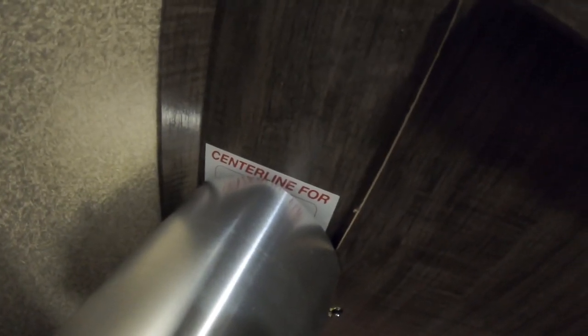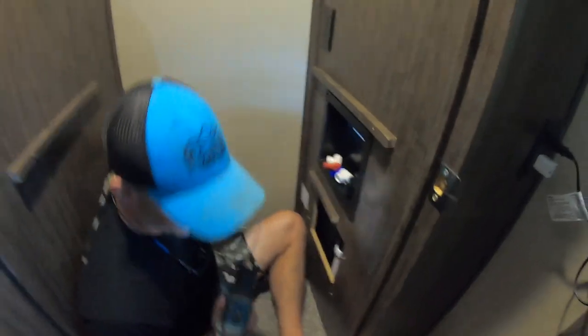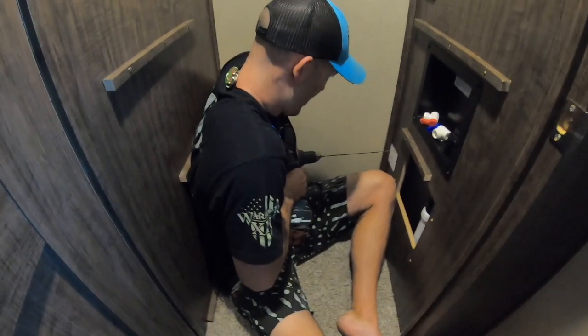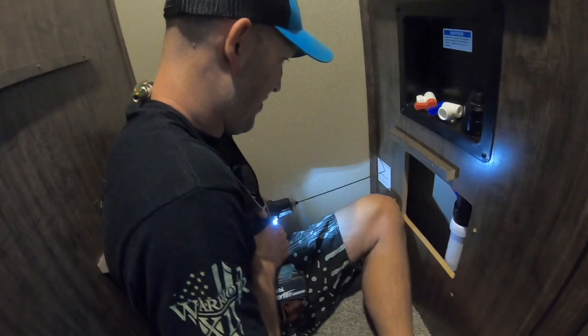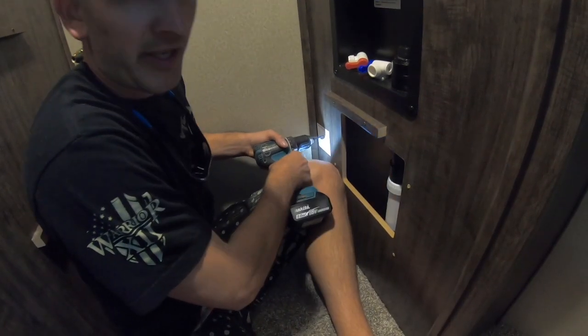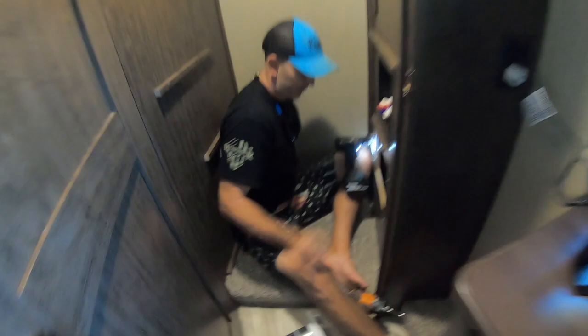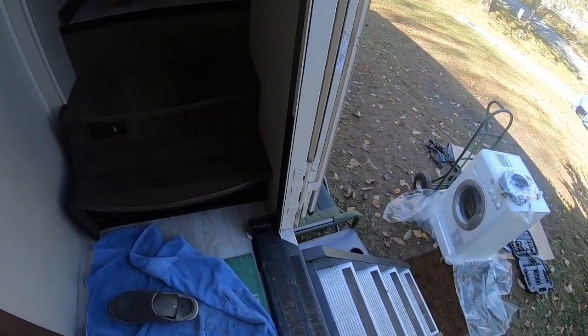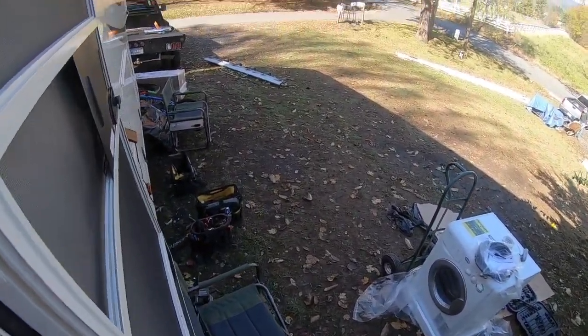Now that we have our new center line, I'm using a twelve inch by one-sixteenth inch drill bit purchased at the local hardware store. Just do your best here — it's a really tight position and it's going to be hard to get a nice level entry point. I started at a slight angle going up, and as I went through the first inner wall, I then leveled out before going through the exterior. It's about the only way I could figure out how to do it comfortably. Now that we've got our pilot hole drilled, I'm going to go outside real quick and see exactly where it came out while my drill is still in the wall. That way, I have a guiding rod to identify exactly where my hole is going to be.